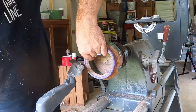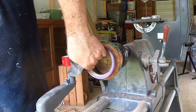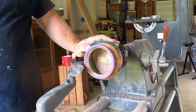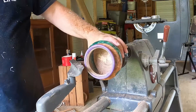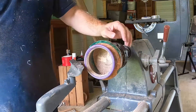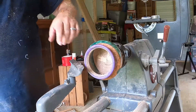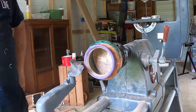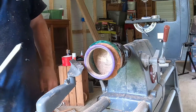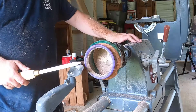We've got our bowl hollowed out and smoothed out. During this process I got too close to the top part on the inside and started coming through to the outside — I came through the resin some, so there's some little holes. I wasn't real sure about this collar anyway with the two-tones, so what I'm gonna do is just part it off right here. We'll put the top to the side and figure something out to do with the rim later — maybe put it in a scrap bowl, fill it full of resin, and see what we make. Then we can get to sanding and finishing the inside of the bowl.